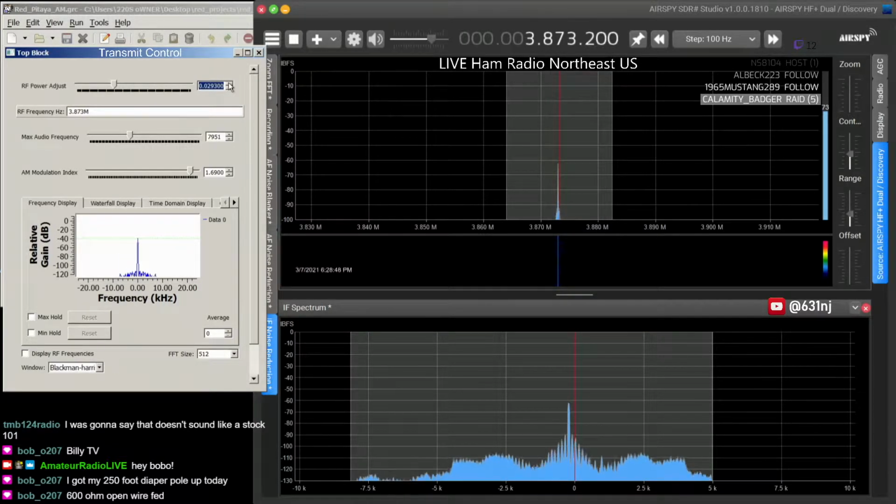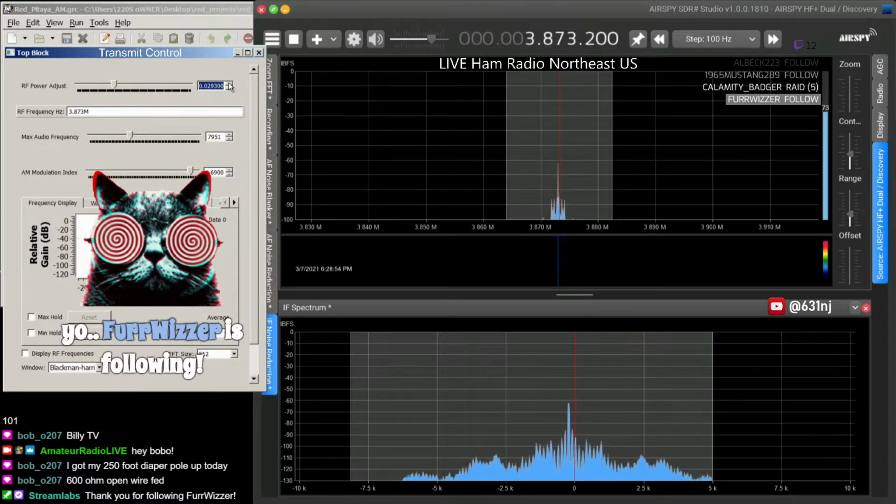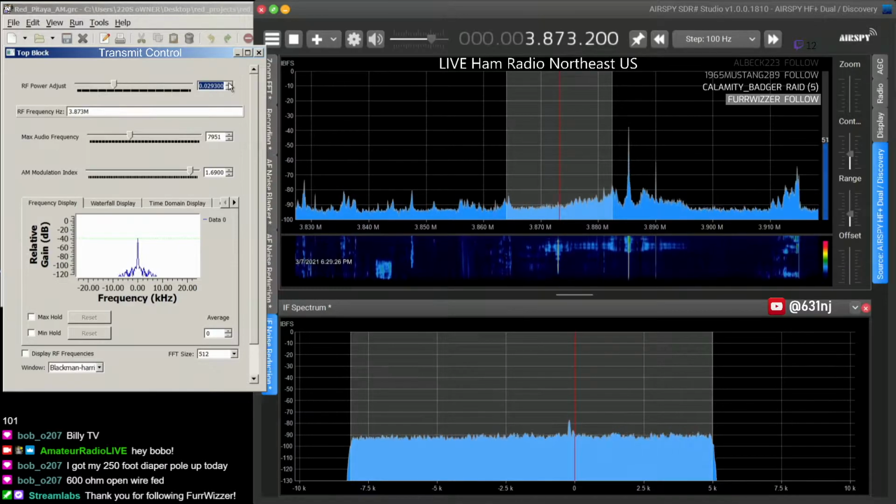I'm using a 100 watt PA pair of MOSFETs to make like 20, 30 milliwatts. And that drives the Harris, and that's a pair of pentodes driving a pair of 8122s driving a pair of 4CX1500Bs, and that brings it up to 40 watts, and that drives the YC156. It's stupid. There's just headroom out the wazoo, more than you'd ever need, but it should be very, very linear.